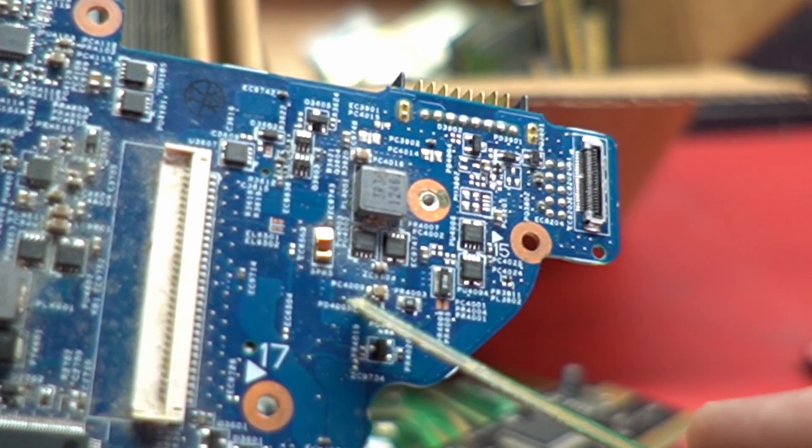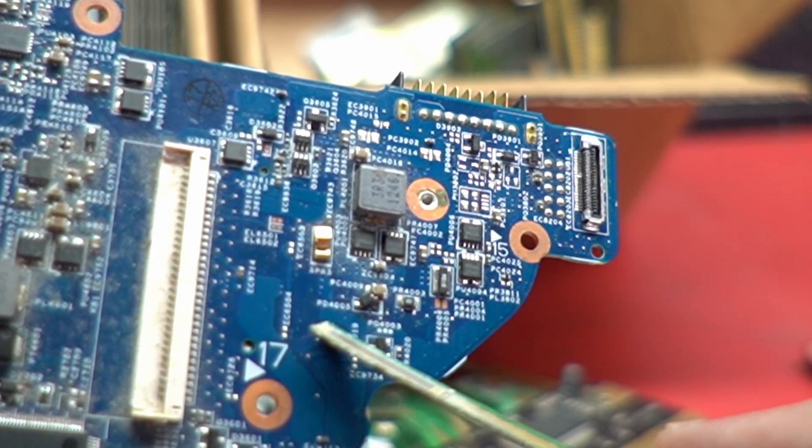In order to know what you're looking at on the board, it's usually marked with a C for capacitor — that's what you want. Other letters could be L for inductor, D for diode, R for resistor, or T for transformer. Generally avoid those. Unfortunately, the price of palladium has doubled in the past few years, so manufacturers have started making these with nickel instead. But you can still get a decent price for a bag like this — about $25 a pound.